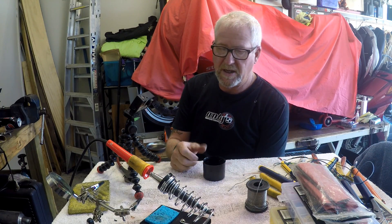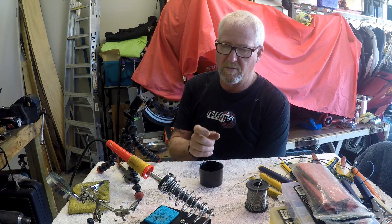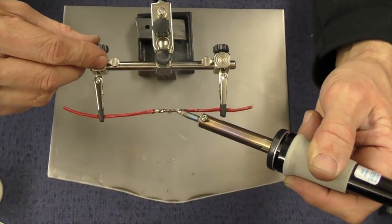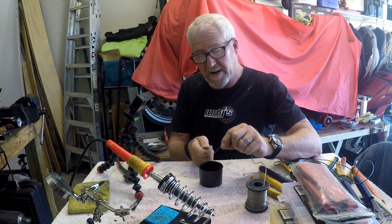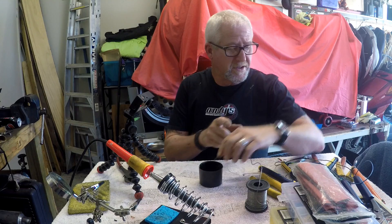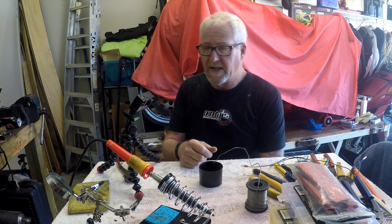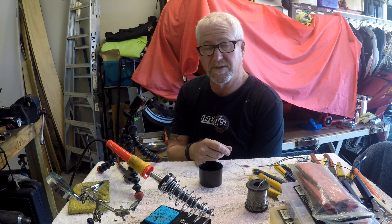So there you go — solder joint, don't overcook it. Make sure you don't do what they call a cold joint by trying to drip the solder onto the top and run it into the wire — it doesn't work that way. You need to heat the wire so it generates enough heat to start melting the solder. Different types of solder, different types of crimping pliers, different types of terminals — happy days. Enjoy your wiring. Thanks for watching, don't forget to like, subscribe and comment, and I'll catch you next time on Andy's Motorcycle Obsessions.